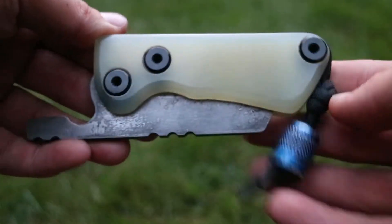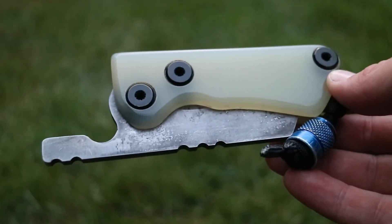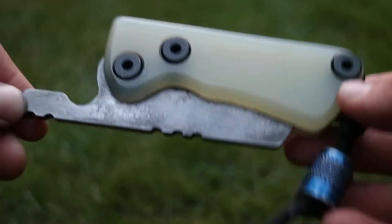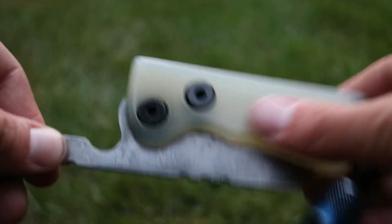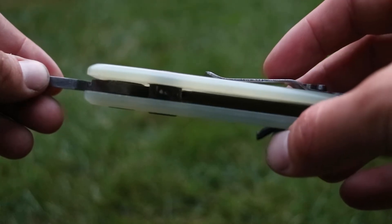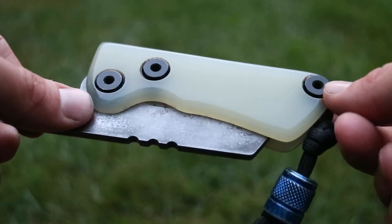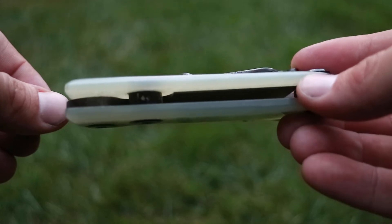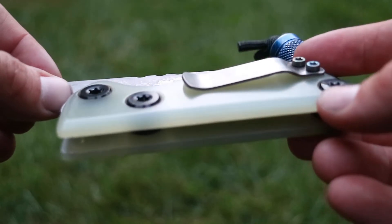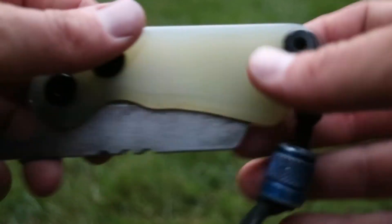This is a friction folder I made — my second homemade knife and my first folding knife. I chose a friction folder mainly for ease of production, and I've always thought they're kind of neat, very simple knives. Right off the bat: G10, .187 inch thick, along with the blade at .187 inch thick, on phosphor bronze washers. The hardware is actual chainring bolts from a mountain bike, and the standoffs are aluminum shock mount bushings from my mountain bike as well — oversized hardware basically just for looks.